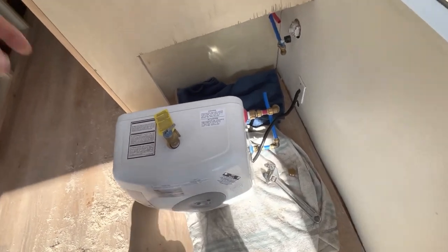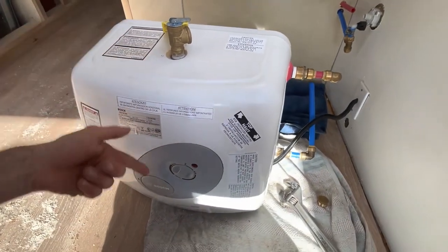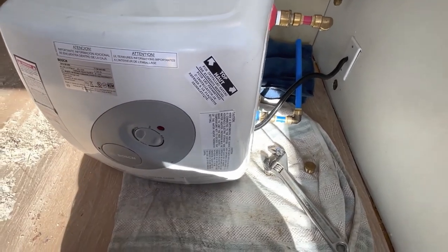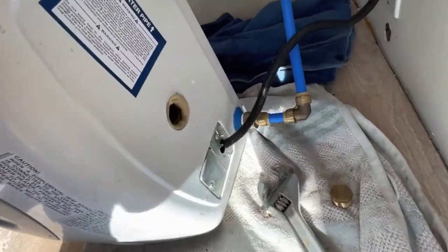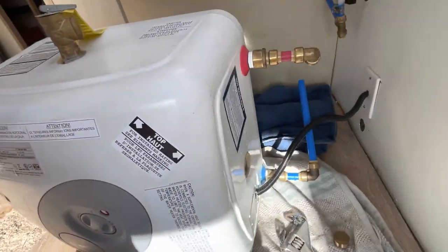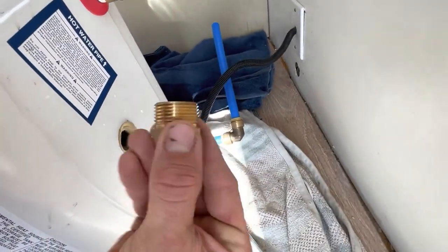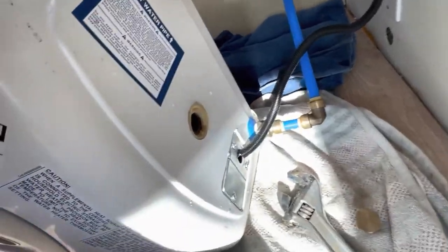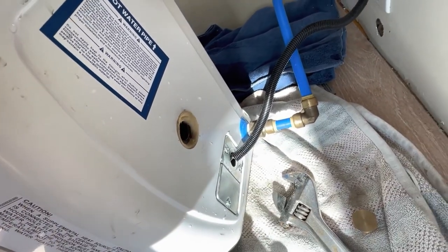Big dummy me - there are two ways you can orient this water heater: vertically or to the side, depending on what you're using it for. There's a plug that fills the other hole and I put the brass plug in, but I didn't put any tape on it, didn't seal it. So it was just slowly dripping out the side down into this little electrical box.